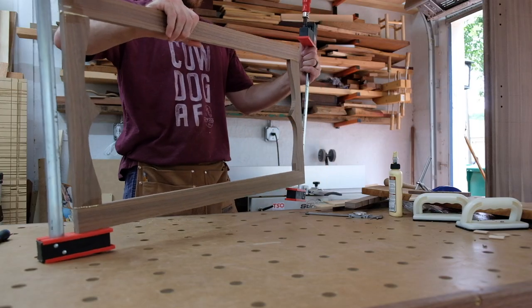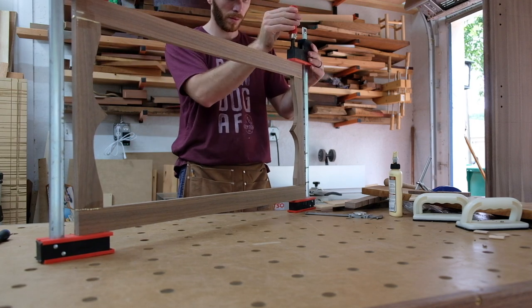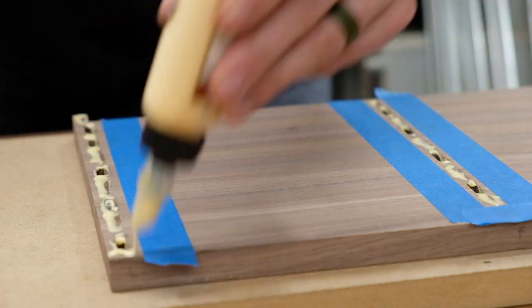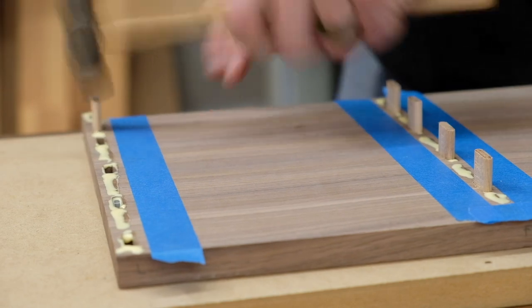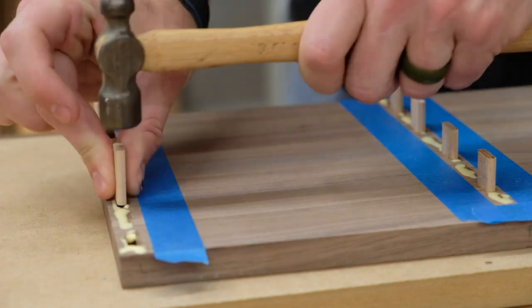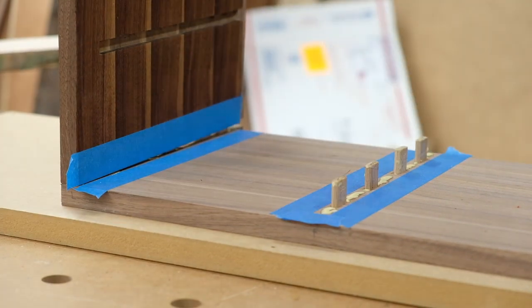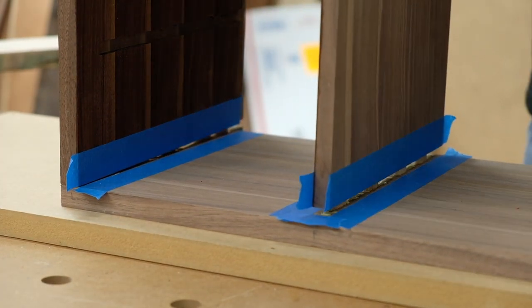After a little bit of sanding on the door and the cabinet, I could move on to gluing up both pieces. For the cabinet, I did do some pre-finishing on the parts of the cabinet that would have drawers because I knew that would be a tight spot to finish later on. The glue-up is fairly straightforward, just adding all my dominoes and glue. I did tape off these joints so that I could minimize the annoyance of squeeze-out later on.